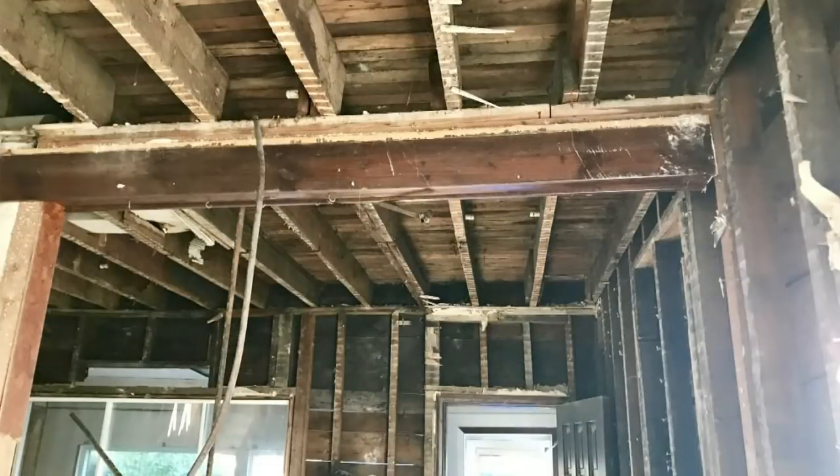Now let's look at the beam situation. A lot of people ask: is this wall structural? It's tough to identify when everything is drywalled and clean. Some telltale signs: go to the basement and see if there's another wall, a beam, or posts directly underneath. If so, that wall could be load-bearing. Also, if the span is really long — say 20 feet — a 20-foot piece of two-by-eight or two-by-ten is a lot more expensive than shorter spans, so you're unlikely to see long spans without some support. These are telltale signs, but until you open it up you can't be certain.